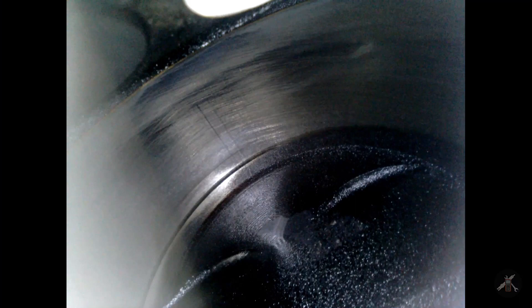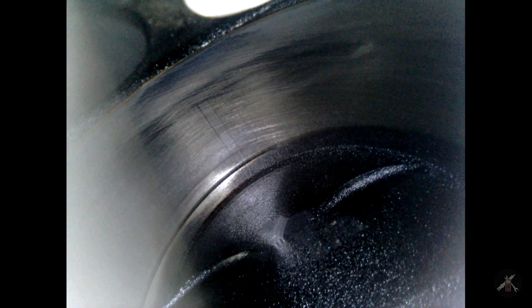I didn't save all the video I used on my borescope camera to show when I got things up to top dead center. Here's a piston that's probably about 90 degrees away and it's going to be coming up to top dead center — you can see the cylinder wall and the valves on top. Here's one when you get it all the way to the top: no shiny cylinder wall left, and the piston is almost touching that valve at the top left of the screen. I was watching the camera as I cranked up that piston until it went all the way to the top and was about ready to start going back down again.